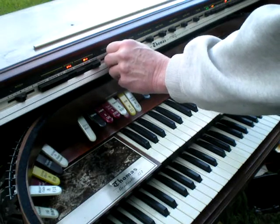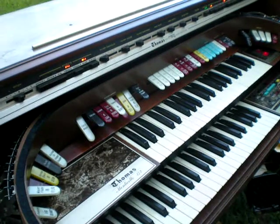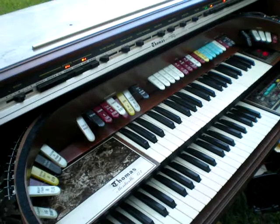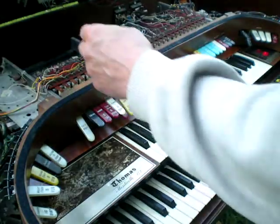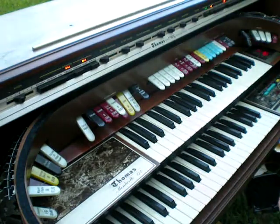The clarinet definitely responds. It's a nice, smooth synth — no digital quirks, it's all analog. There are a lot of things you can do to it. You could easily put a daughter board on and, regardless of what version you have, upgrade the filter to a 24 dB and make it a lot more interesting on the low pass part. It's got these little cards with all the presets. You could pull one of those, pull the resistors, put digital pots in, and create a programmable card that stores memory of different sounds you want.